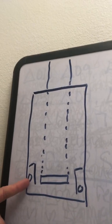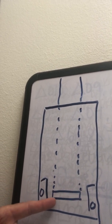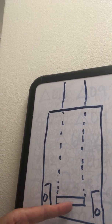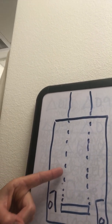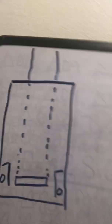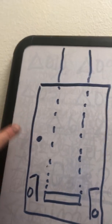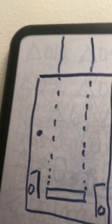A couple of things you can't see in this drawing: the burner is here, the bag wall is here, the target brick would be in front, and this is the opening for air to escape into the chimney. This diagram shows you the back of the kiln and the chimney. One other thing you don't want to bump when loading or unloading is the pyrometric thermometer, located around here, which gives you the digital readout on the control panel for the kiln.